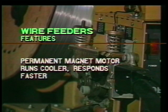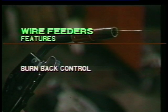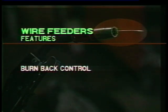Consider the following features when selecting a wire feeder. The drive motor is the heart of the unit — a permanent magnet motor runs much cooler than a shunt motor and also responds much faster for improved stops and starts. Gas coverage is critical at weld stops and starts, so a practical feature would be a pre- and post-gas flow control to ensure gas coverage, as well as a gas purge switch to eliminate air from the gun. Burn back control eliminates the need to keep trimming the wire for correct stick-out length, and correct stick-out ensures minimum spatter at weld starts.